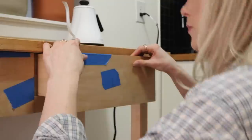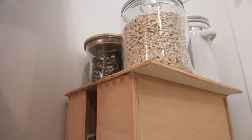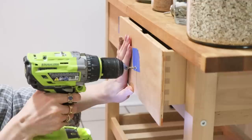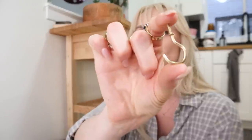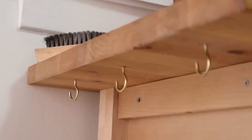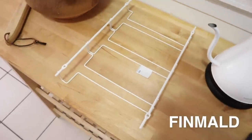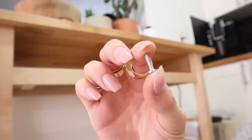I used tape to help hold things as I figured out the placement. Once they were in place, I stacked some heavy objects on top to add pressure as they dried. Once the drawer faces had time to set, I pre-drilled holes in the center for new knobs. Then I'm adding three one-inch cup hooks to the side so we can hang barbecue utensils or any extra things. Finally, I'm adding an IKEA wine glass rack to the underside of the island to swap space between the island and my cupboards, attaching it with a small pilot hole and some screws.